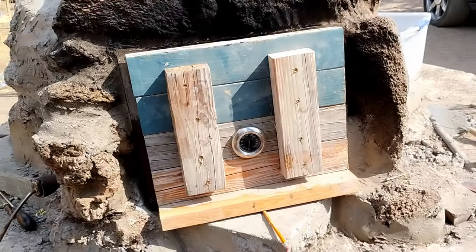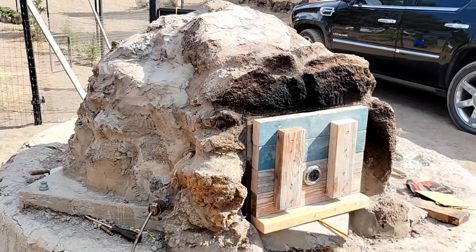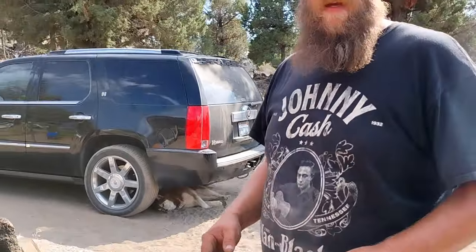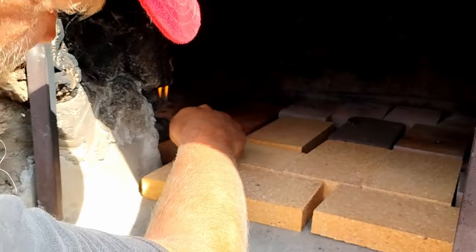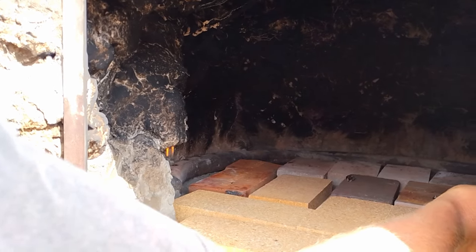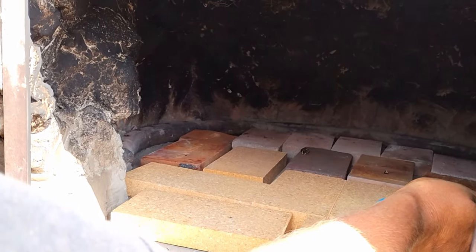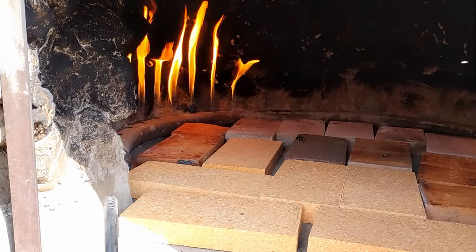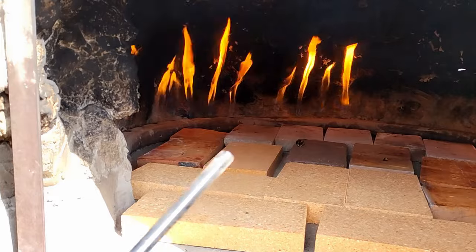This will work great as a temporary door until I can get some hardwood together, or maybe even some steel, and make something nice. Let's do a test burn with the new burner. What we're looking for is less of the orange to red flame and more of the blue to light orange — that would be a more neutral flame, somewhat on the oxidizing side of the spectrum, and that's what we want. It's a lot of heat and that's what we need. Like a kid on Christmas finally getting to open the big gift under the tree, I was so excited to see what would happen. I was also a little afraid that my new mixture of propane and oxygen would cause this thing to splode — but I have a beard, so I can't show that kind of emotion in public. It's in the bylaws.